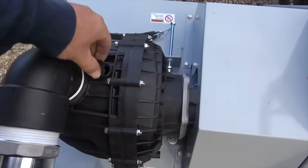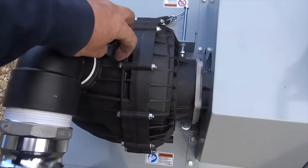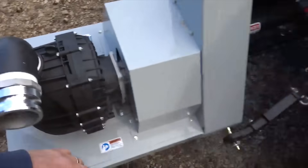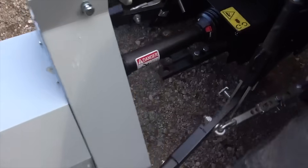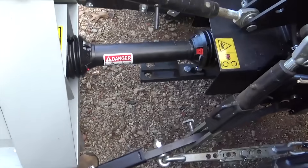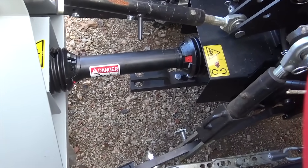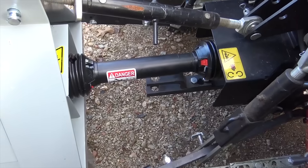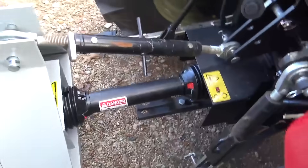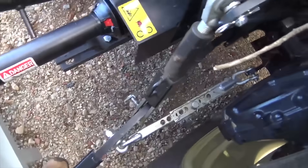I'm going to go ahead and prime it. The first time I might have to prime it every time — that's one thing I do have to work on — but I'm going to prime it because I'm used to priming these types of pumps. It's a little compact unit and the distance was pretty close to the back of the tractor, so the tumbling bar I received with it had to be cut. That's not a big deal — you cut both halves, I cut about two and a half inches off each, and then a relief on one so you can put the shaft together. That's pretty normal.